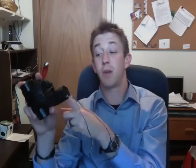And time for the sound effects. If you hear a sound, you might still have a valve that's still seeping by. Sometimes it's very faint, so you can actually put your ear up to the valve, or put a flathead screwdriver to the top of the valve body and put the handle up against your eardrum, and you can sometimes hear a hissing sound. If you do hear that, you might still have a valve that's hissing by.